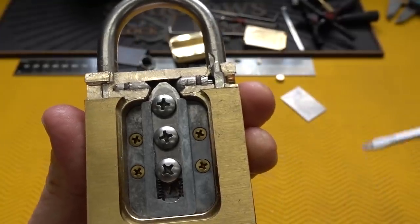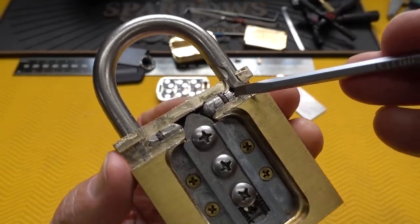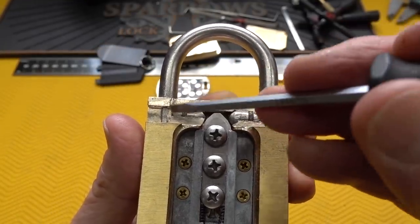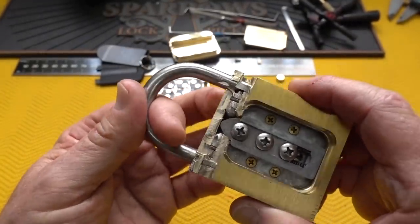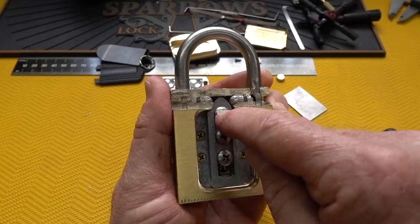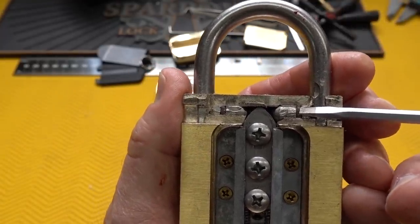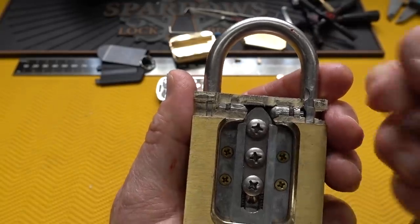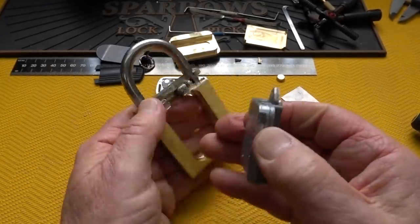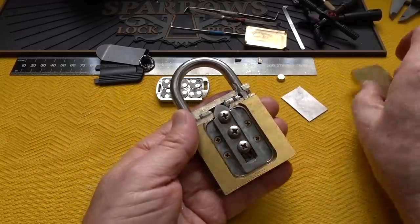I thought these were ball bearings — they're actually cylinders with rounded edges. And this is not a ball bearing on this side; this is simply a bearing surface that goes up against the shackle. The other side looks rounded. So how does it work? These locks are really not spring loaded — when you unlock it, this whole mechanism retracts. This little domed area right here will slide down. As you pull up on the shackle and put pressure on these, they force against that rounded edge and cam it down out of the way, allowing you to get an open. So the locking mechanism just slides out. This is how they build them — they slide the locking mechanism in, take that back plate, slide it on, knock it in flat, and then refinish it.